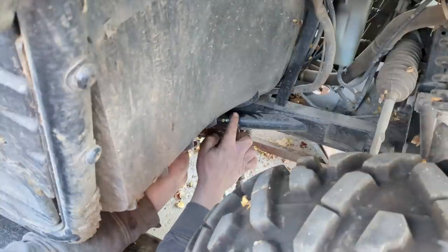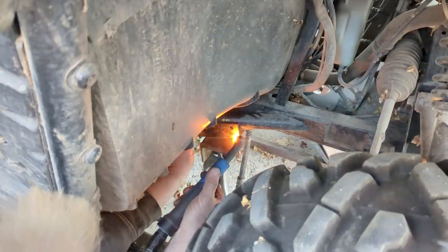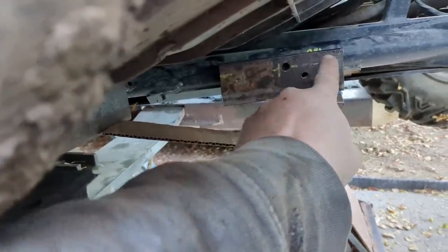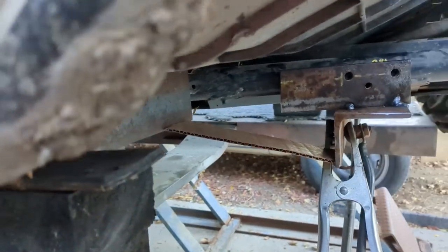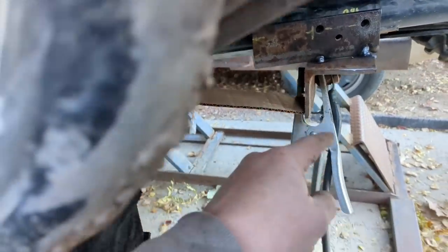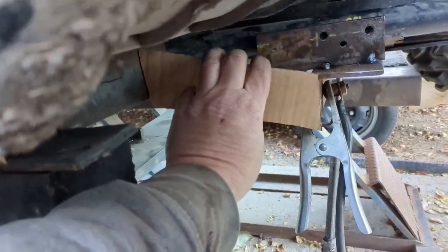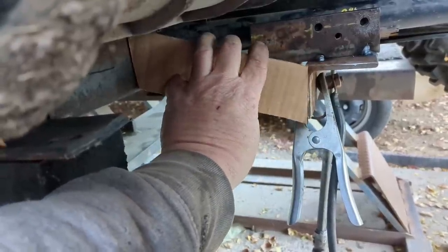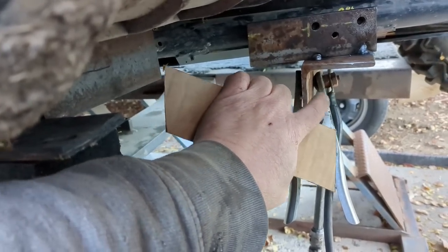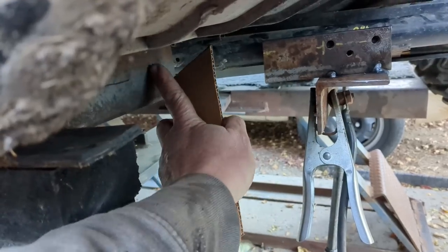So these are actually going to have holes drilled all the way through and be bolted on. I'm just going to set them here and weld them while I have them here, at least tack them. So I took the cut off of this angle iron right here and it's pushed right back against here. This will have bolts through it and there will probably be one bolt back through here because all the force is back there. But I need to tie this to this — at first I was just going to extend this back but that's not going to be enough. The further out I am the better. You can see I have one cardboard template across the bottom and then one piece right here that braces off the end of this. That will take all the force — any force from the plow will push off this and push directly onto this beam right here and spread the load across the entire thing.